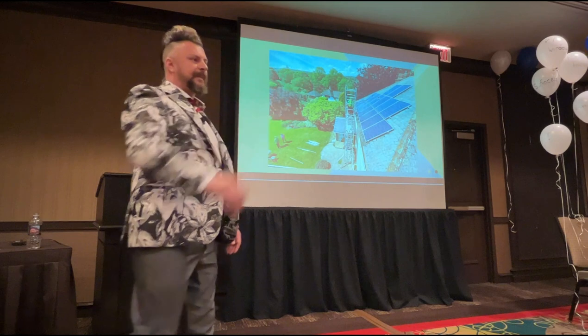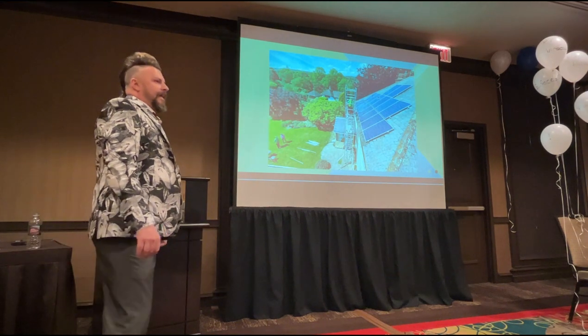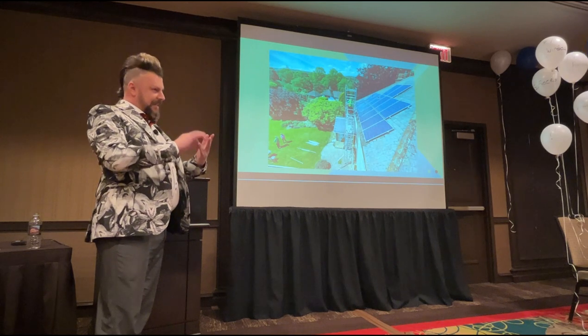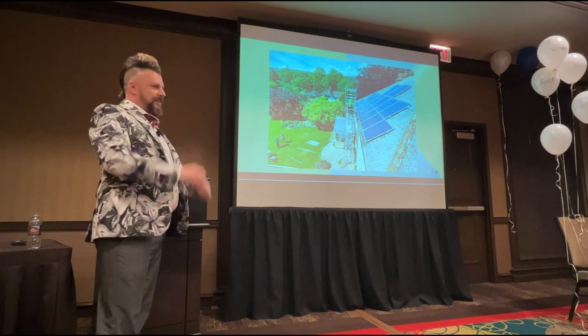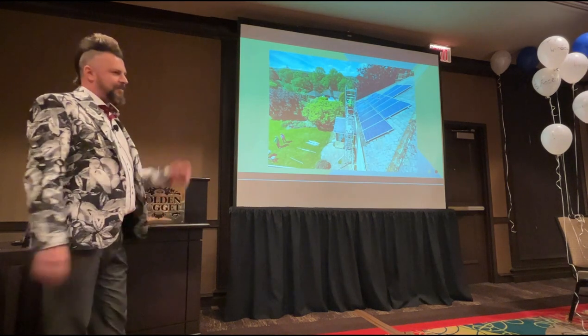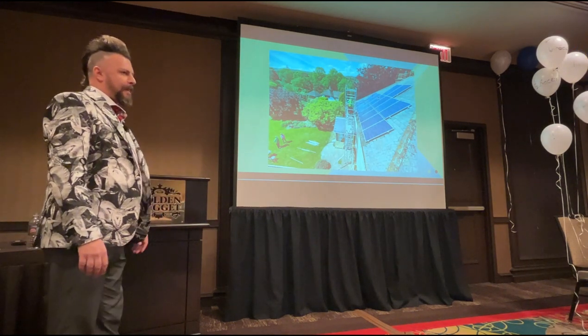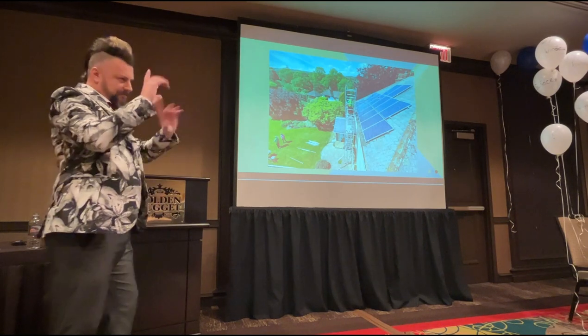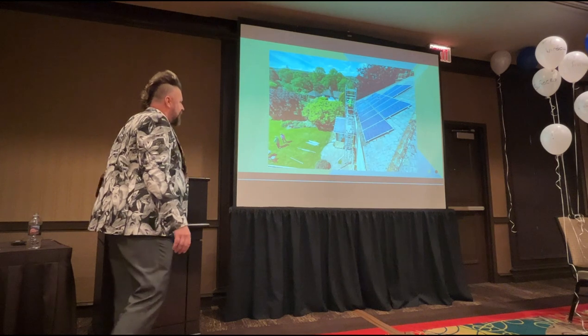So what do you use to take the lichen off? We use an approved chemical. That's the first thing, and then we're using plastic, not metal scrapers, in order to take it off. But that's probably a whole class of its own for about 2 hours on how to do that process properly. Does the roof need to be washed? No, because the water just rinses it all down. But that's a different subject for a different day.